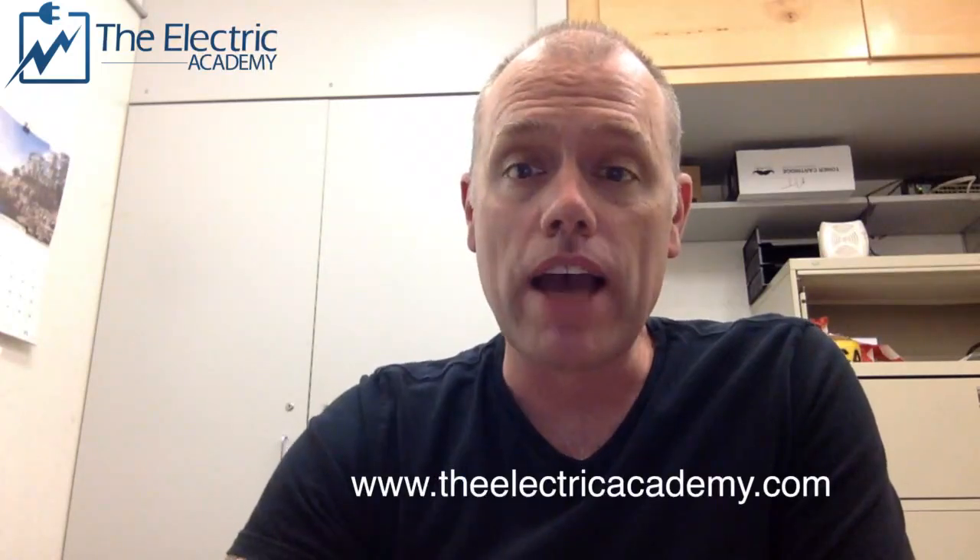I'm getting lots of good emails and feedback from you guys. If you missed this, go back and watch the replay — I'll post it on Facebook and probably YouTube as well. It's a really important topic: do not switch that neutral, watch out for the open neutral. When I was in a hotel a few months ago, all the lights went dim and some circuits didn't work because we lost the main neutral — and with an unbalanced load, weird things happen. The neutral is important. Work safe, talk to you tomorrow, bye.